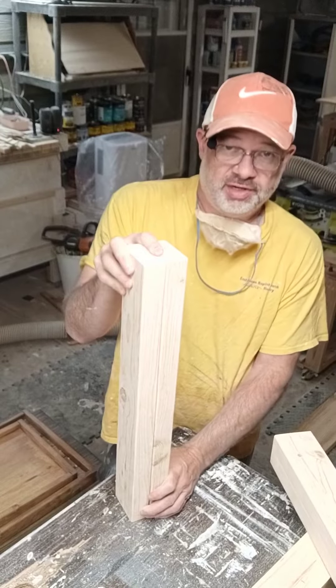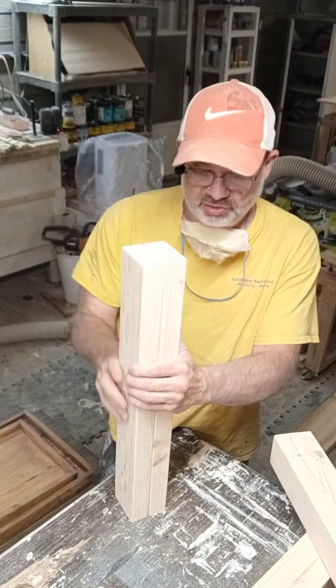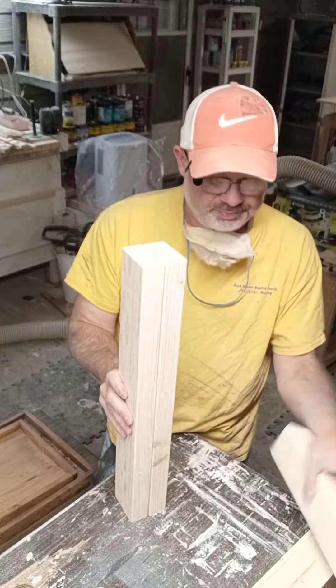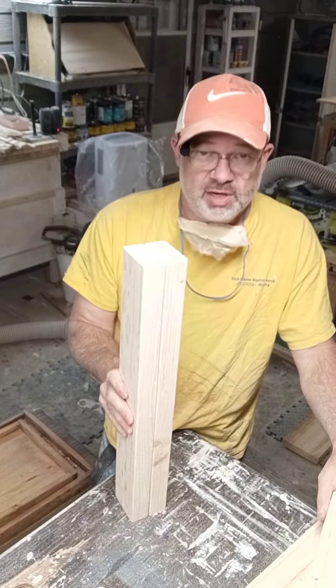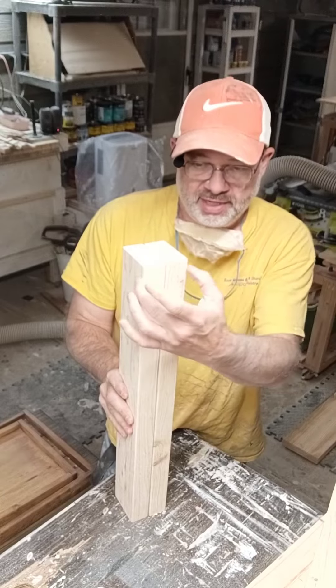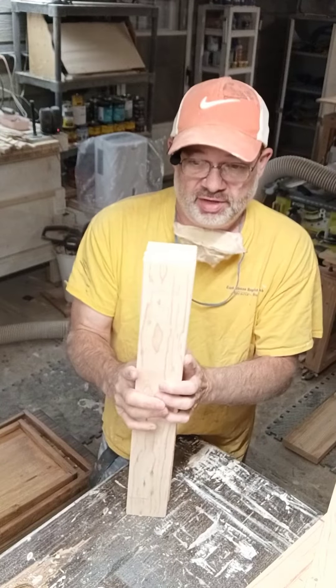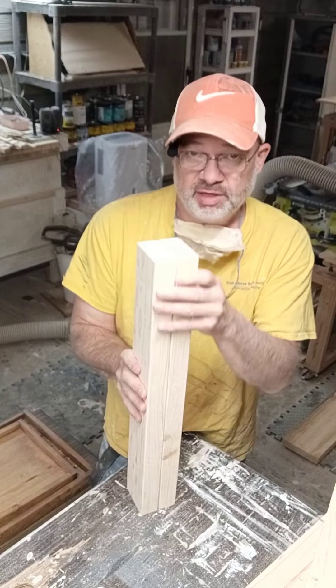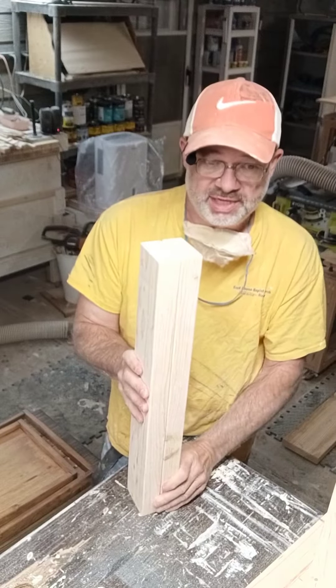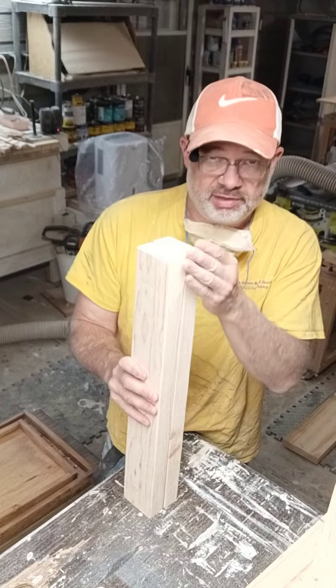Just to make it look a little bit better and make it more sturdy. Once these things are glued together, I get them on the table saw and I'll cut down the side here. Even if I get glue squeezed out from putting them together — mash them and the glue starts squeezing out from the cracks — it's not going to matter because I cut it.